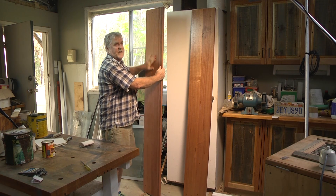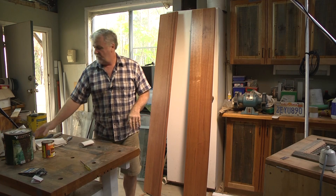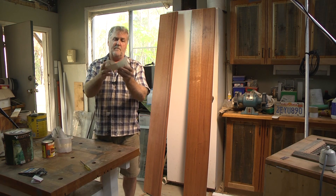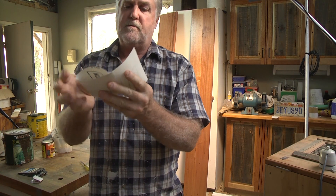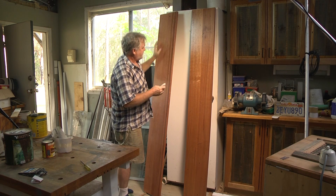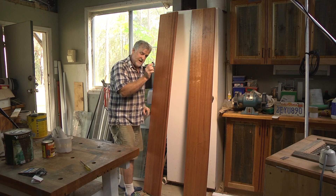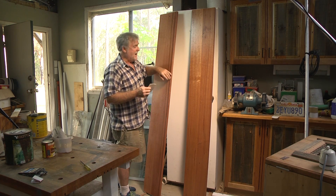Our shelves have had a whole day for drying. They're good and dry and ready for sanding. Now, if I rub my hands over that, it's just super rough. We're going to sand that. I use 180 — you can get away with maybe 220 or 240. I always buy sandpaper by the roll. Cut a piece off, fold it in thirds. If you just take a piece and fold it together it slides, but if you fold it in thirds it doesn't slide at all — it allows you to sand a lot easier. When sanding the edges, be really careful not to sand that edge off because it's got stain on it. If you sand too much off, you'll sand through the finish, through the stain, and you'll see a white mark — it'll be the timber and it will show up pretty bad.